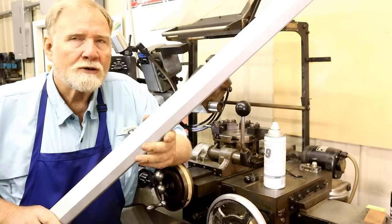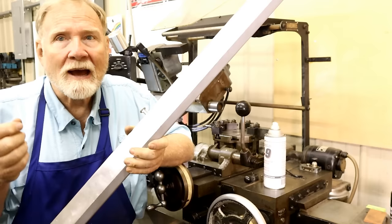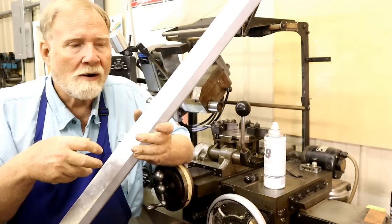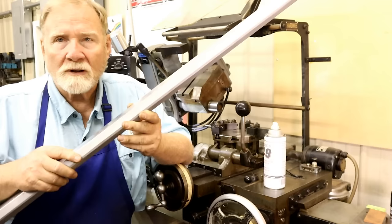He told me some really tight tolerances that you need to sand this to. And what happens is, imagine in your mind a piece of sand. It's not smooth, it's jagged. It's like a piece of glass. It's got sharp edges on it. Now pour that sand into a pattern here and pound it so that it all clumps together and sticks really hard. And then take this out. All those jagged little edges of that sand get pressed under pressure against this. That's what him hitting on the side of the mold does. It releases this by vibration.